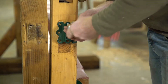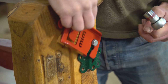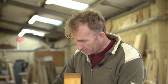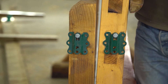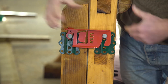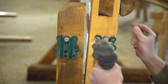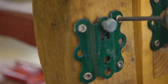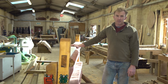Don't over-tighten this nut too much — just allow the clip to fit on snugly. Once we have both bolts in, before screwing the plates up, just check that your clip does fit correctly. If it doesn't, you can give a little bit of adjustment so that the clip fits snugly. Now we're going to screw these plates in securely in place — just make sure these bolts don't move.